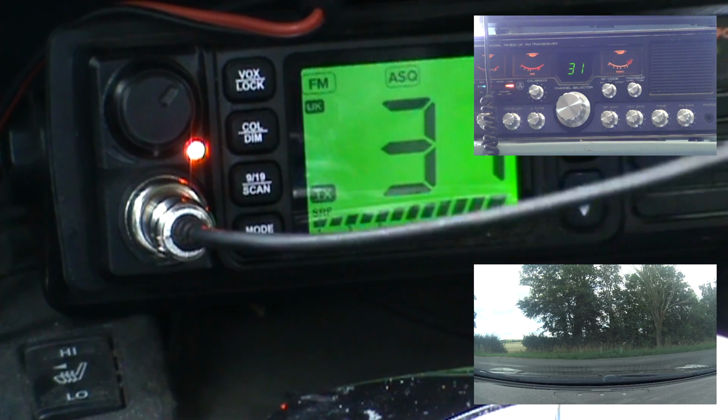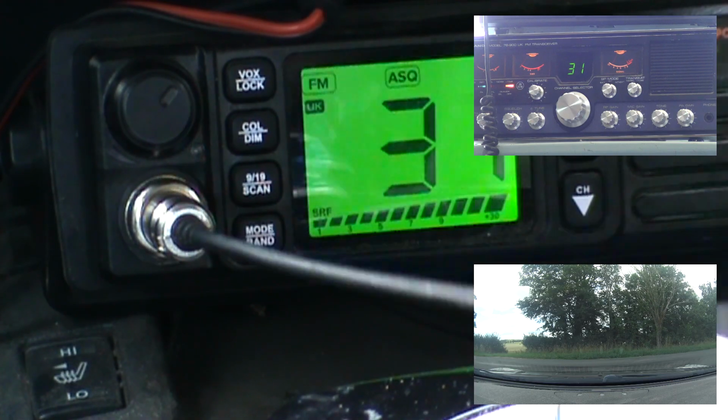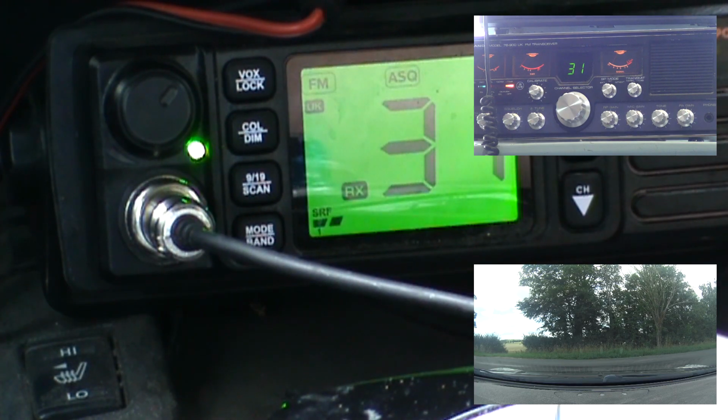Tango 21 from Mr. Chippie. We're now at the 5 mile point. Roger, got you the 5 mile point. I'm on this Murphy CBH1500 base station. I'm on a standard replacement microphone. The radio's doing 4 watts output. It does have low power, but it's factory set, and it's 210 milliwatts.